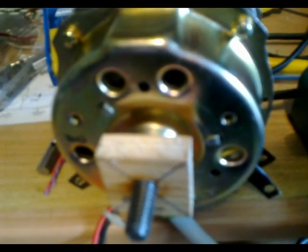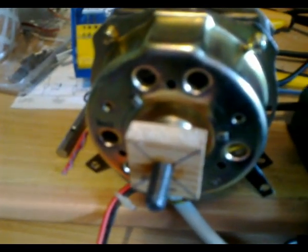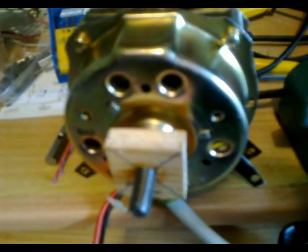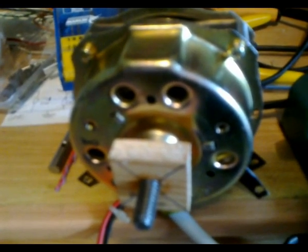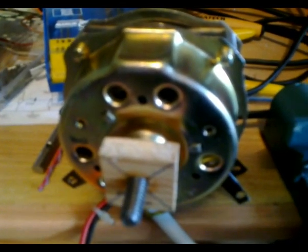When I was working on this motor earlier, I accidentally dropped it and it fell onto the concrete. One of the windings broke off and the motor wasn't working — I thought I'd lost it. So what I did was I pulled the two broken coil wires apart, put a bit of tape over the other windings, and soldered a wire link between the two broken coil wires. Fixed the problem — a botched job, but it did the job.